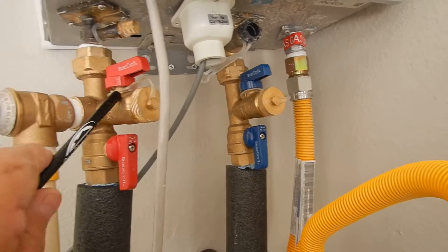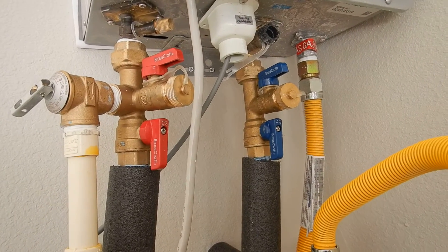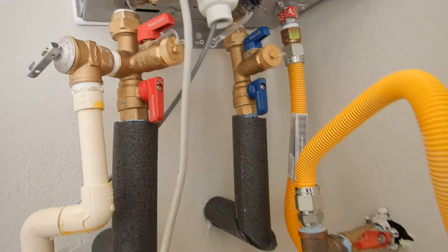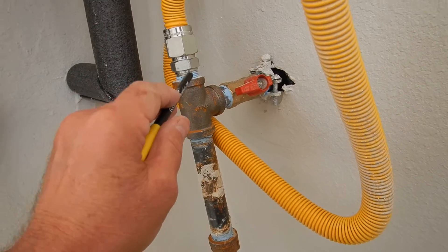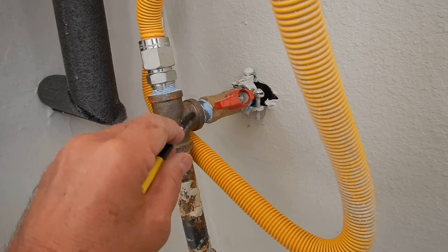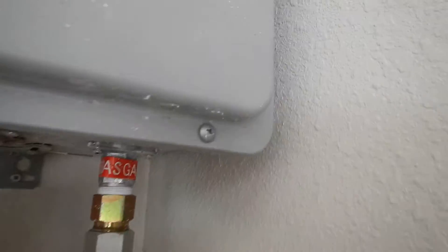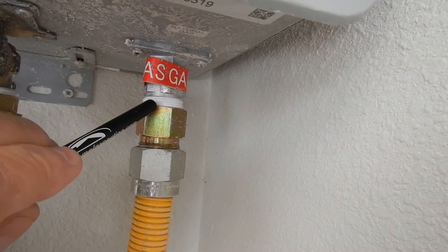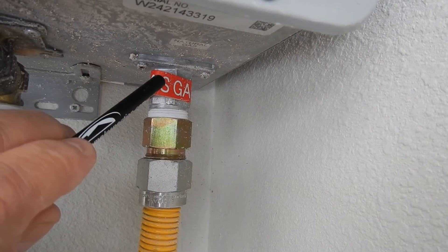There's a screen inside — don't just open that up. You've got to isolate these things and read the manual, or find a walkthrough on YouTube. You can see all this blue pipe dope — that's good, we want pipe dope on our connections. Sometimes you can use yellow tape, but see this white tape right here? That's for water connections. White tape is not approved for a gas connection.